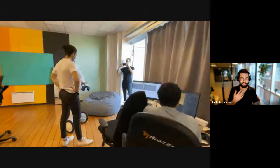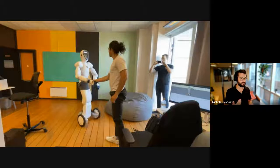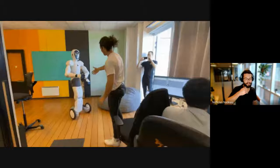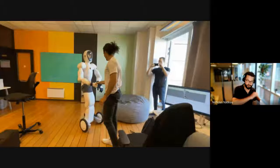It's very dangerous. With our robot, because everything is direct drive, because our transmission ratios are almost 1-to-1, and we use a capstan rope pulley system, everything is back drivable. And so this allows us to create a holistic, safe robot application from the ground up, from intrinsic design on the robot side to the extrinsic design on the application side.